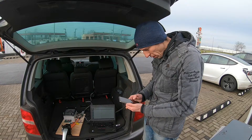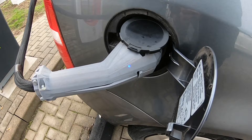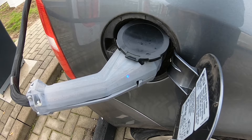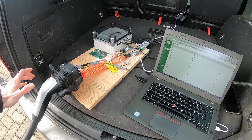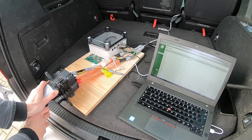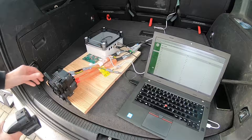There's one little flaw — I'll stop charging now, but it's just not going off. The Tesla charger has signaled it wants to stop but we don't detect this yet. We're still in state current demand. Current has dropped to zero, so we slowly retract the connector. Now it went into error state and we can safely unplug.